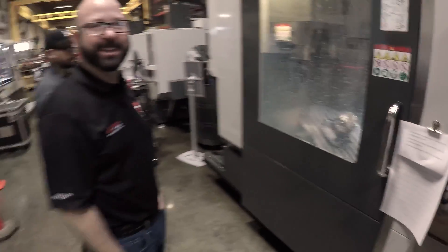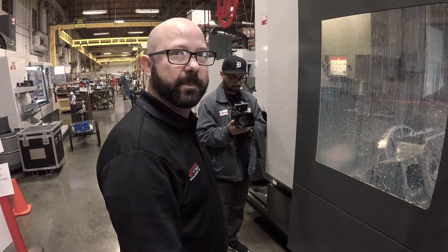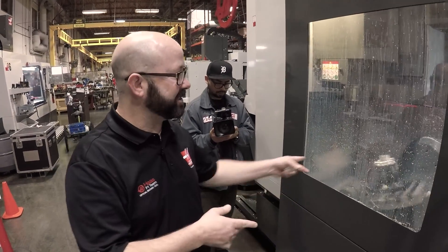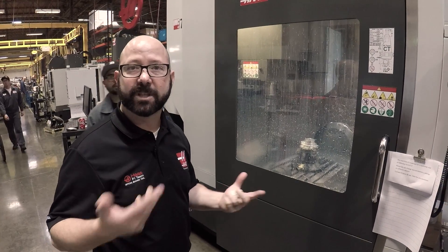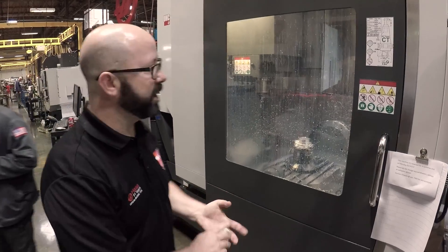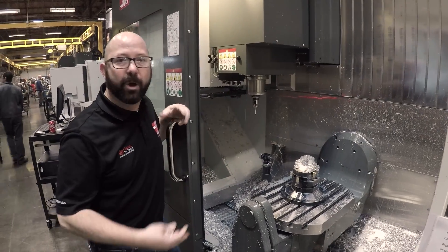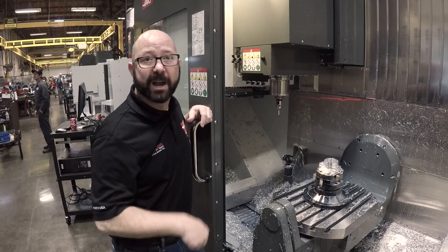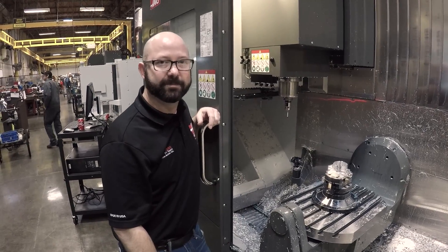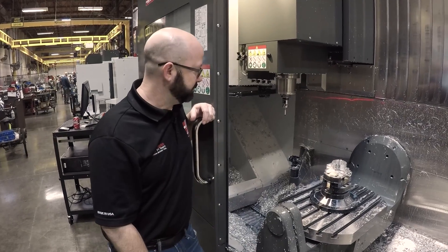Usually by this point in a ten-minute program I've walked away. If I was running these things all week long, I would have gone to Home Depot and got a caulking gun and black silicone — I would have filled every counterbore on the table. Seriously, because all these T-slots fill up with coolant and they hose me down when I blow them off. Literally just fill everything, and when the job's done, grab a screwdriver and pop it out. RTV silicone — no big deal. Love it, especially on dedicated fixtures.